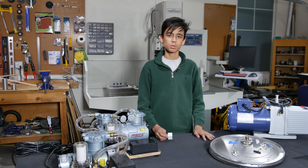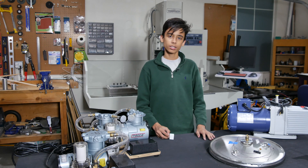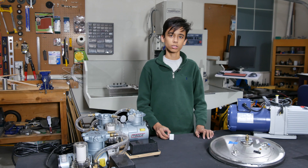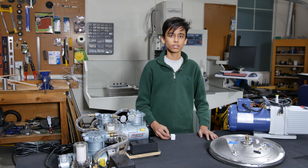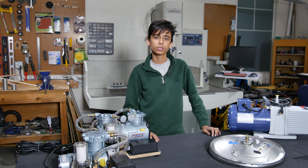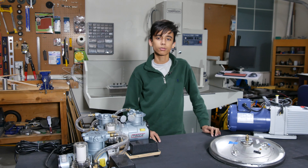After the lid was secured, the vacuum pumps are started. The vacuum level in the vessel can be monitored on these digital manometers. At first, the pressure drop is pretty fast, but it slows down as the pumps get closer to their limit. At some point, the vacuum level does not increase anymore, and so we kept it there for a while. Then we opened the valve to let the air back in. Pressure testing works similarly — we pressurized the vessel to 7.5 bar, let it sit for a while, then released the pressure.